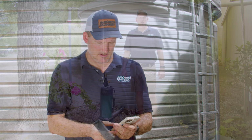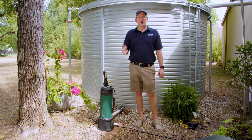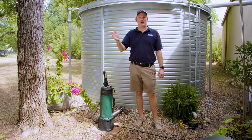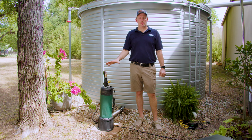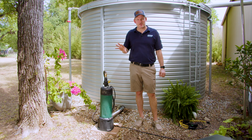That's how it works. So again, the ESYBOX Diver from DAB is a constant pressure, variable speed, on-demand pump. On-demand means you open the tap, somewhere in your home or an irrigation valve opens, and the pump's immediately going to turn on. You don't need a pressure tank necessarily. You can use one if you want, but it's not required for this pump because it has it integrated into the pump itself. And because it has a soft start feature, it will speed up and slow down, and it never comes on with a hard start like a typical traditional pump will do.